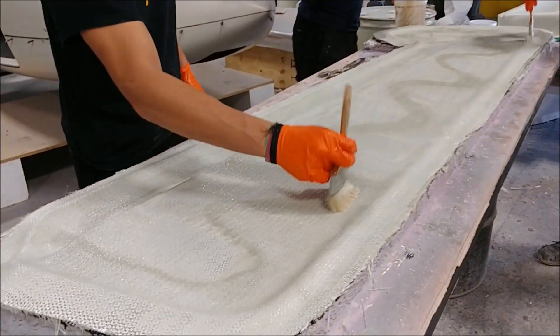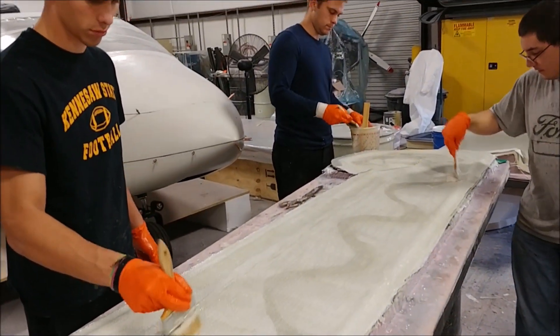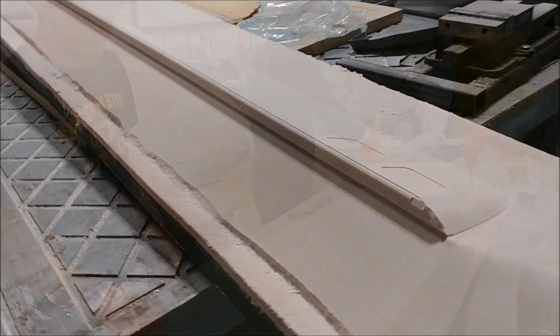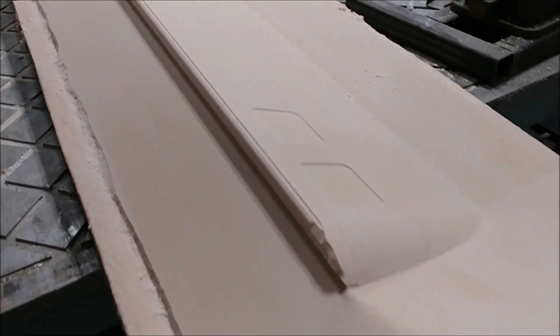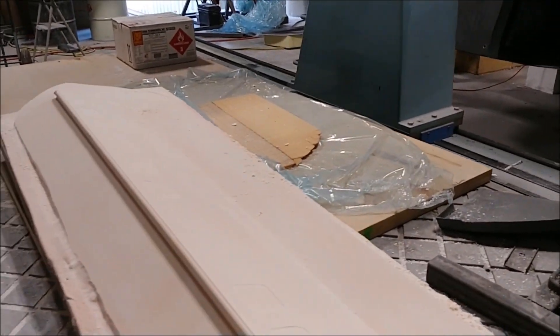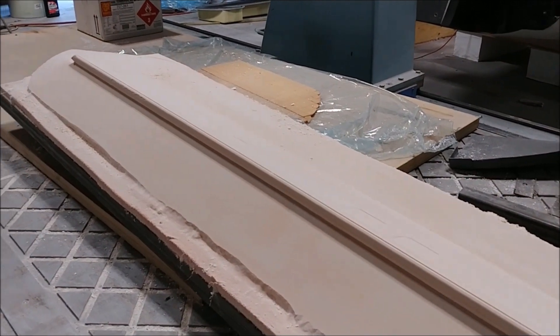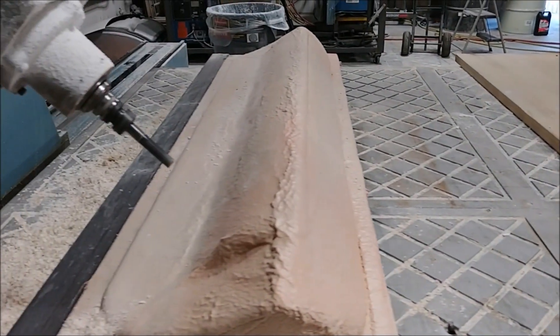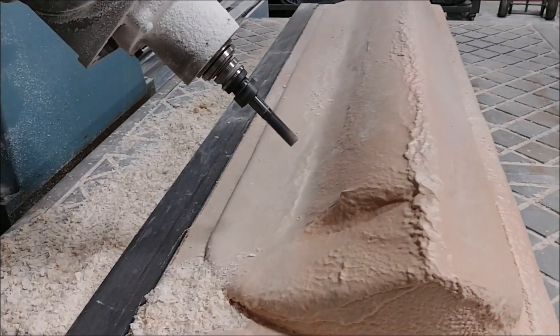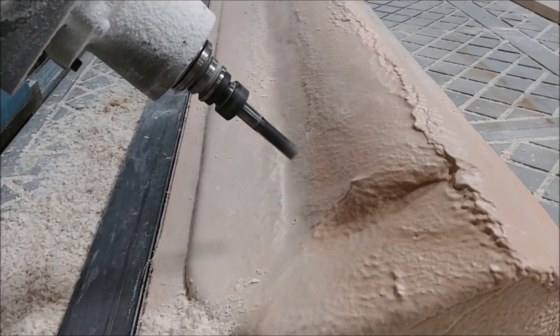You can see them just wetting down the glass there. The lower elevator plug is now finished — a couple of little touch-ups needed, but that's usual with finicky edges. It came off nicely. Here's the one for the upper skin just about to get underway.